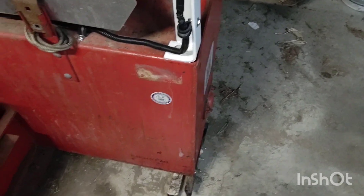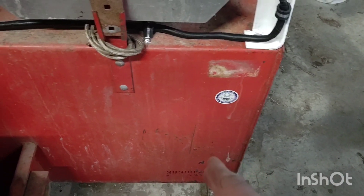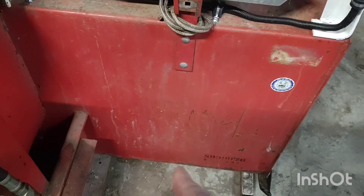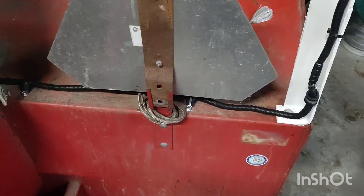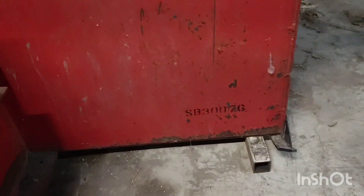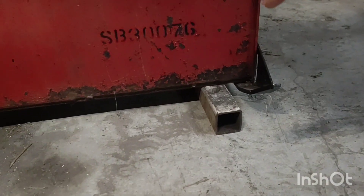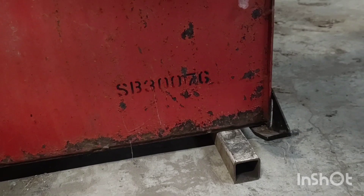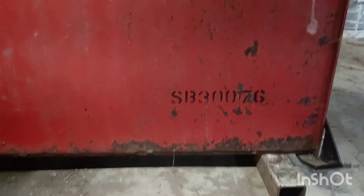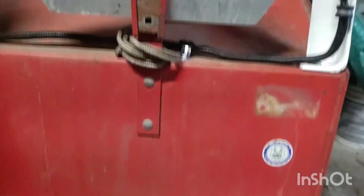We're going to do another option. The next option is to come in from this side of the blower, come in about 10 inches, and I've acquired some wheels. I'm going to put them right here on the back side and let those wheels ride on the rock about an inch, inch and a half up off the ground. The blower is sitting on about an inch and a half square tubing right now, so we'll use that to gauge our height and mount the wheels so that the blower stays an inch and a half up off the ground as we're pushing snow.